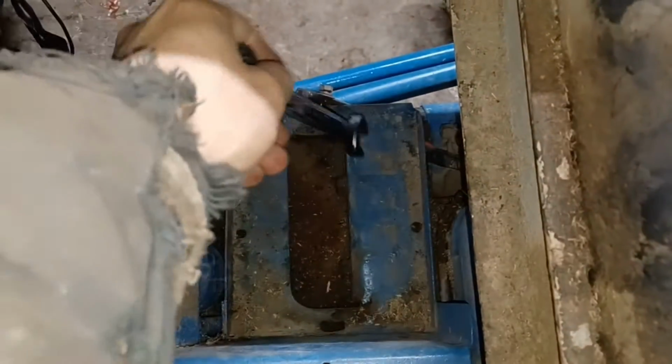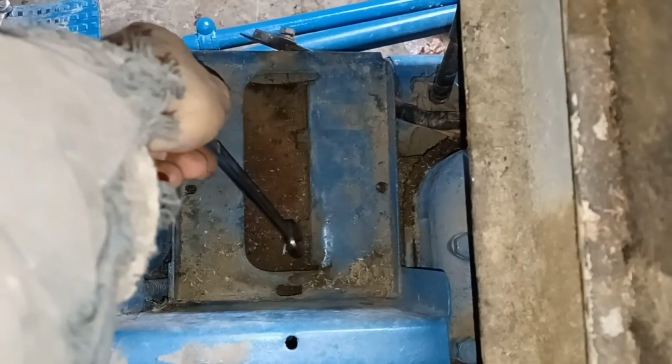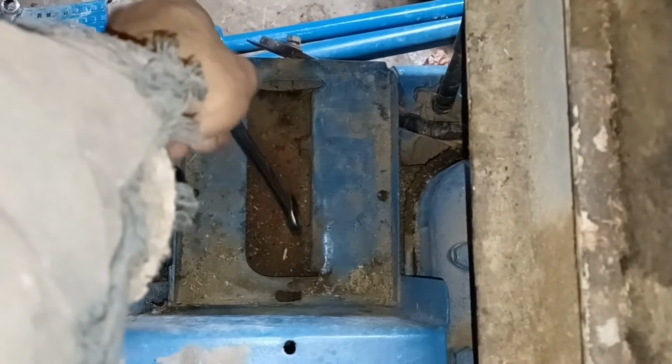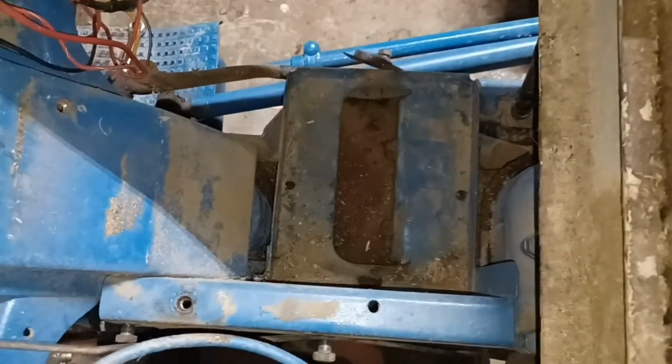So in order to do that, there are two bolts down underneath where the battery goes. There's one here and one right there. And these are actually bolts that run into the back of the engine block. So you're going to have to take those two out to get that battery box out, but that'll take that entire assembly out of there.